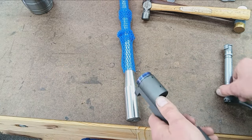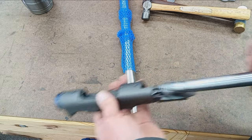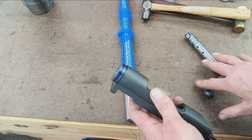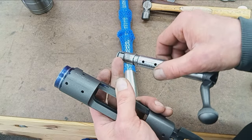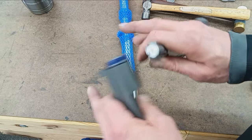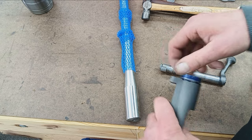the bolt's not going to close because the cone breech is not machined. So obviously that's not going to close. But that diameter does not change. That specification is fine. Now the bolt's going to sit in there differently because the internal lugs have been machined, the face of this has been machined. So we still need to do some measurements to get our headspace number established.